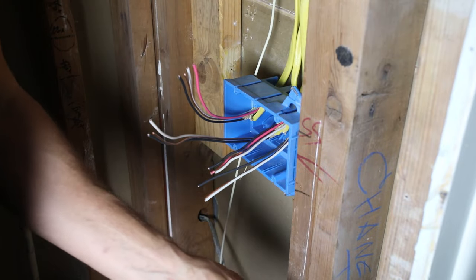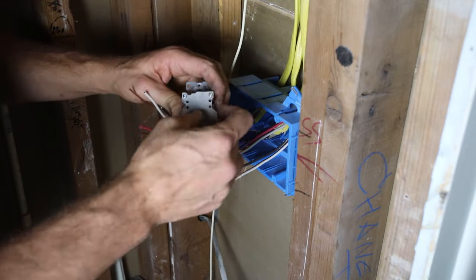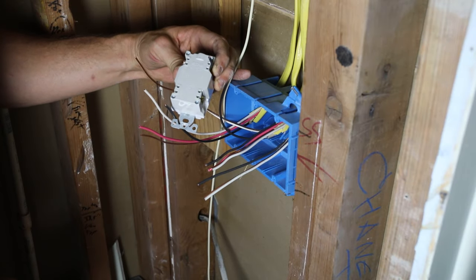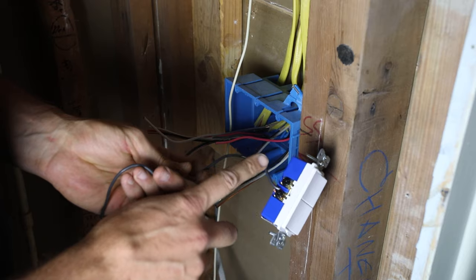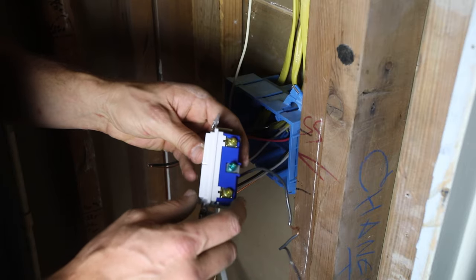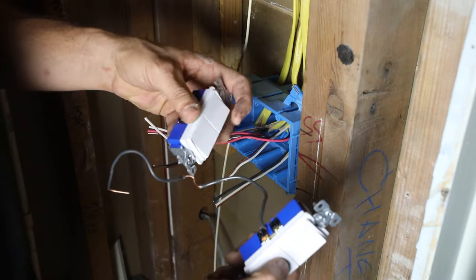We're going to power this whole bathroom on a GFCI circuit. Power wire comes in and goes to the brass side, white wire goes to the silver screw, and then we pull power and neutral out of the load side to feed the rest — that will protect the entire circuit. I'm using a double switch in one unit: line power comes in and splits over the two switches via a jumper prong. I made a little jumper wire — stripped on each end — to connect the switches and get power to both sides.